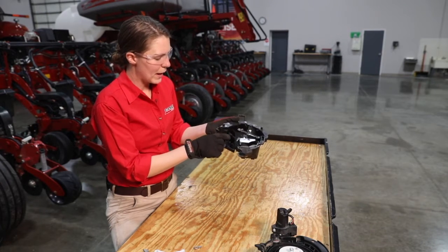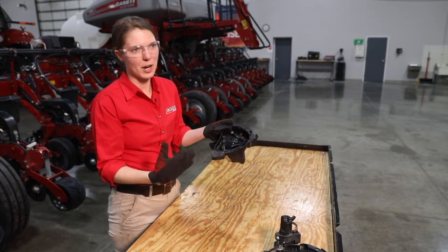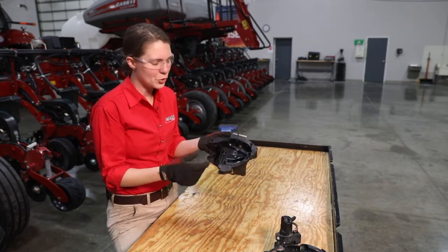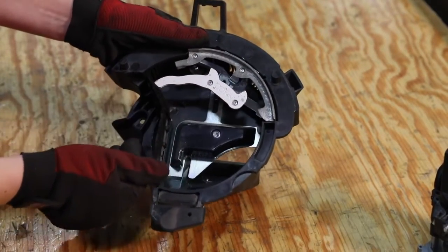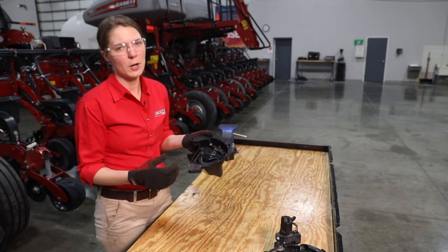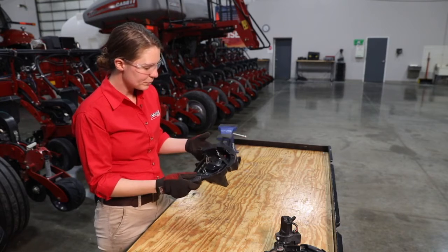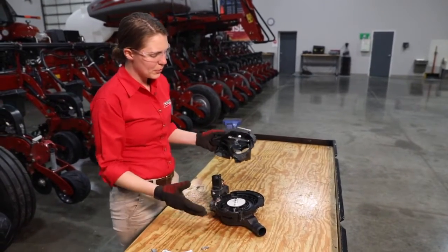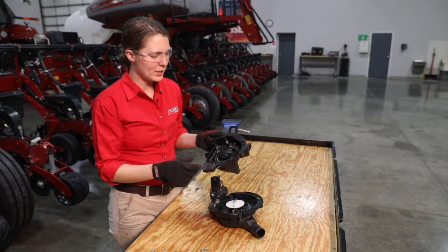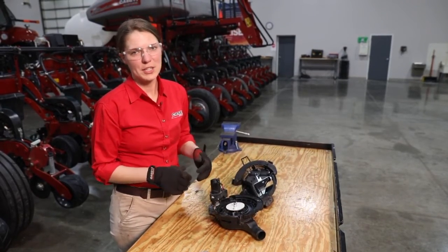The job of the brushes is to hold seed in the seed pool and keep it out of the gravity drop seed tube or the speed tube area. What we're looking for is whether the bristles are matted up with seed treatment and whether they are free-moving. If they are frayed and catching product or seed in them, or matted up to the point that they can't properly brush anything away, that's a good time to replace those brushes. For both meter housings, it's always good practice before each season to blow them out with compressed air and clean them with soap and water as well. For any further information, consult your operator's manual or contact your local Case IH dealer.